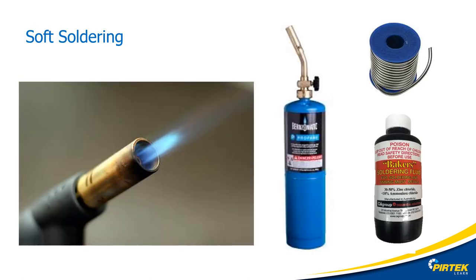A quick look at soft solder: soft solder melts at around 400 degrees Celsius and is not suitable for joints that require mechanical properties. It is extensively used in the plumbing and light fabrication areas. Note that some solders contain lead and are not suitable for plumbing applications.